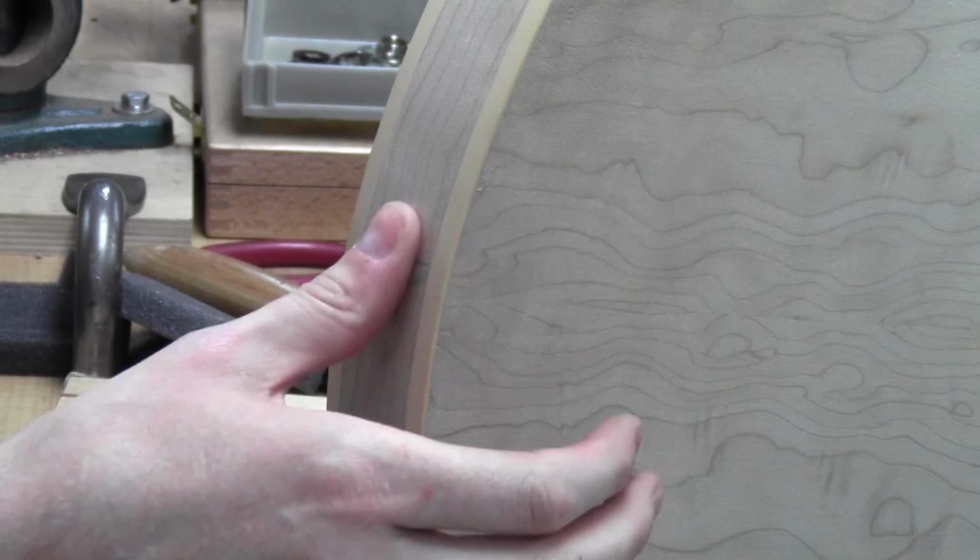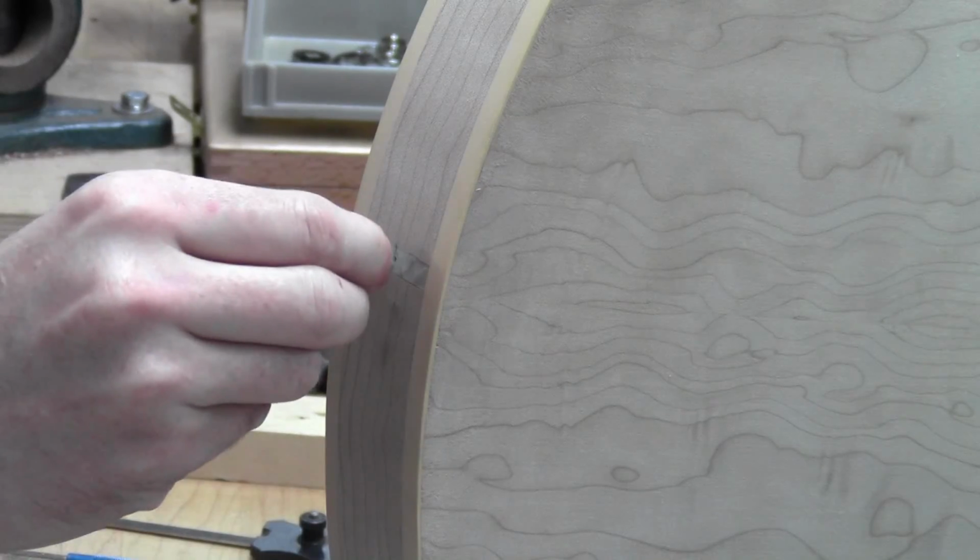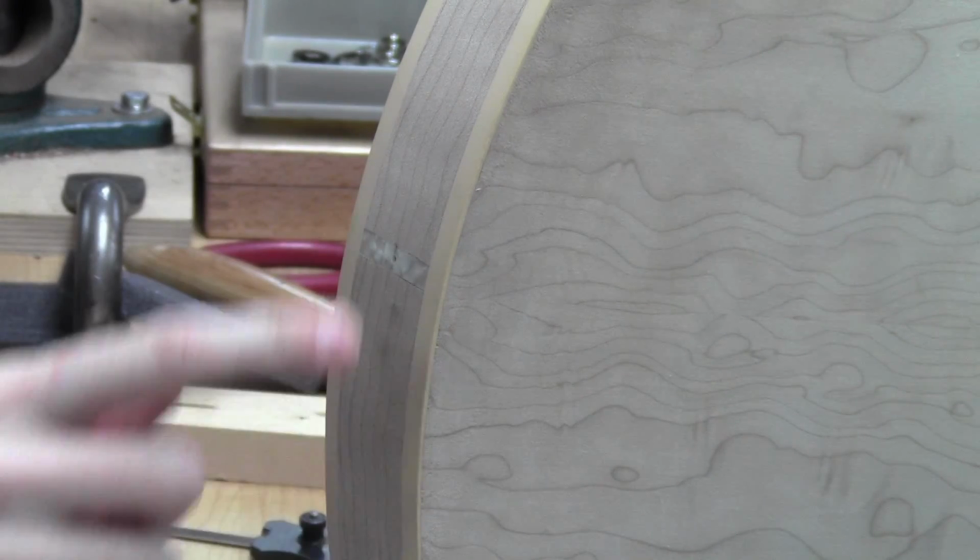And that should be the screw hole for that. I'm a little concerned about the thickness of the screw screwing around with my binding, so I'm going to come at it with a slightly larger drill just on the plastic part so that it doesn't get too crazy for me. Basically, I'm making a shank hole in the pickguard.